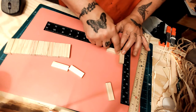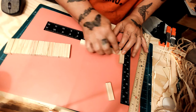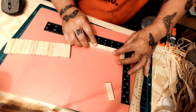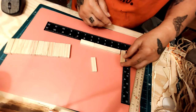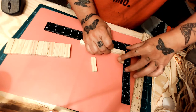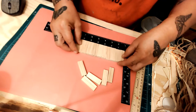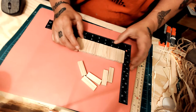After I did this part — because you're going to have the five pieces together — after I did this part I should have done the other three here. After I made sure that this was squared up, I should have flipped it around and done the same thing with the other one, not just putting pressure at the base but putting pressure up here as well. So that caused it to not be squared up when I went to put my box together, and my box looks like crap.